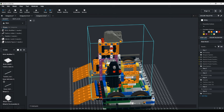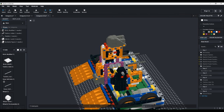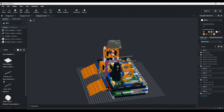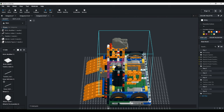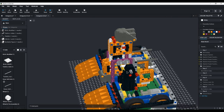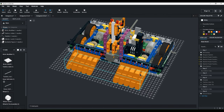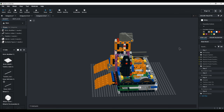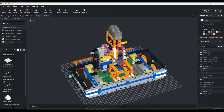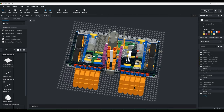So I needed enough torque to spin the weapon while it was hitting the floor in case the weapon stalls when I get flipped over, and I needed enough kinetic energy to give it enough momentum to flip itself back over. So 1-to-1 gave it enough torque, but it didn't give it enough kinetic energy. So it could not reliably self-right with front attachments on. Without the front attachments, it could self-right basically every time. But the moment you put even a single brick separator on the front of this thing, the front becomes heavier and it wants to tip back over more when it's trying to self-right instead of tipping back over to its wheels. So the weapon self-righting was a bit unreliable, and this thing didn't have many fights.